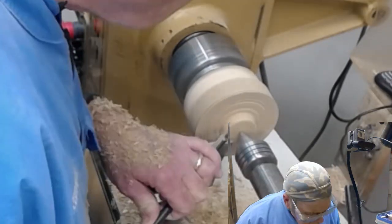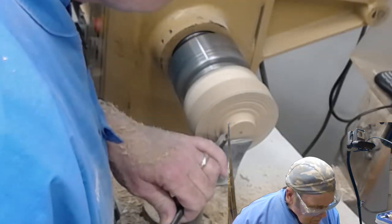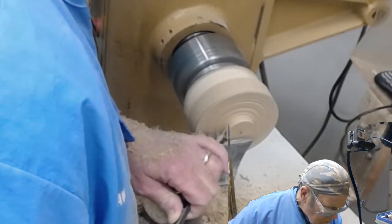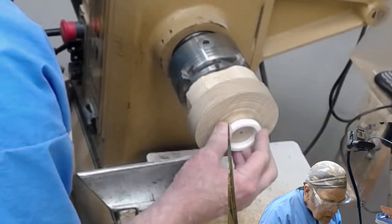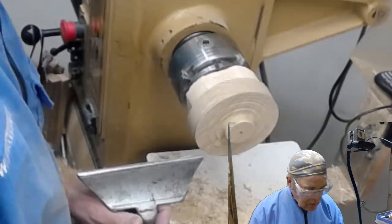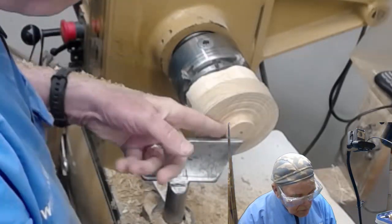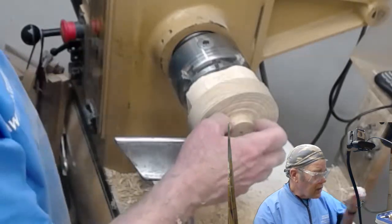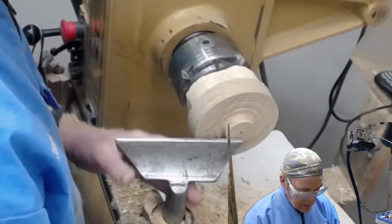Okay, now, so I start just a bit of a chamfer there. Back this off. Okay, looks like it's just fitting over that chamfer. So now we're just going to make sure we're pretty doggone careful here in getting that to fit. And so before we do, I think I want to go ahead and finish flushing this in so I don't damage that area, because these threads are going to fit right up against that wall like that. So let me take care of this.